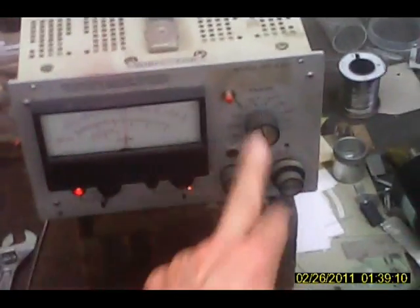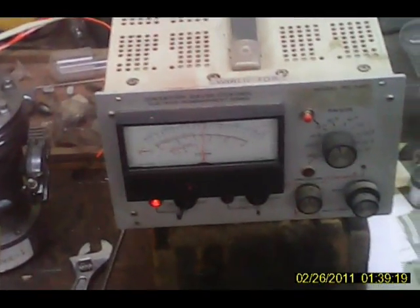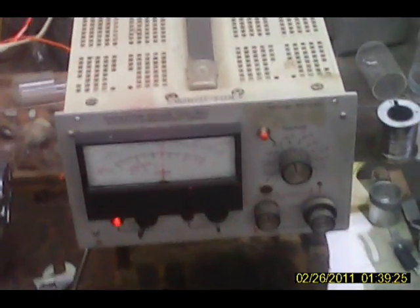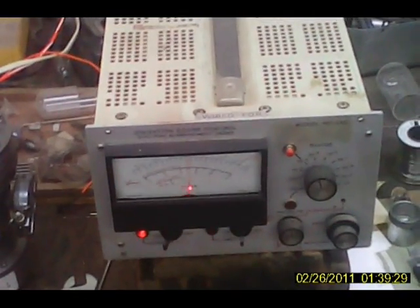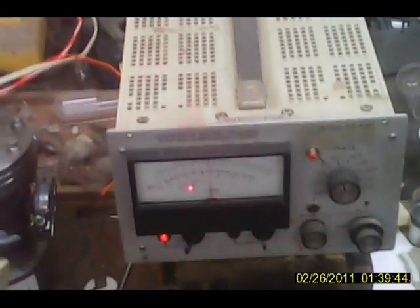This one's working fine. We're reading about 5×10⁻⁵ Torr right now, and that's after about five minutes of pumping. It's a little bit faster than a diffusion pump — a diffusion pump takes about 30 minutes to start up and another 10 minutes or so to get down to this level. Once it's going there's no comparison — the diffusion pump is much faster — but when you consider the warm-up time, this is faster. We're going to let this run for about half an hour and see how far down it goes.